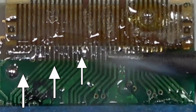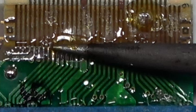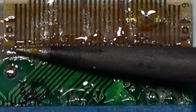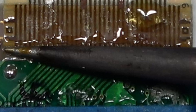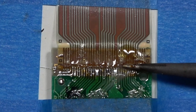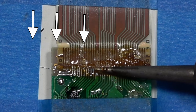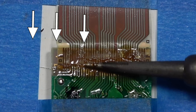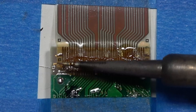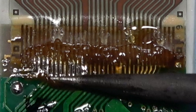By using the flux and just moving solder around, you get the bottom tinned. After they're tinned, I like to flow the solder upwards — by flowing it upward you're pushing solder up the PCB traces and getting it underneath the ribbon cable, which is where you connect the ribbon cable to the PCB. The ribbon cable was lifting up, so this step pushes it back down to the PCB to make a solid connection, though the plastic starts melting in the process.